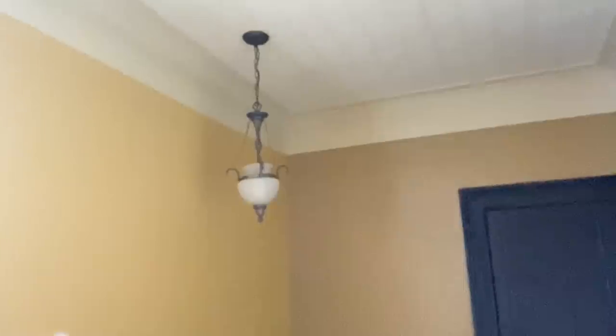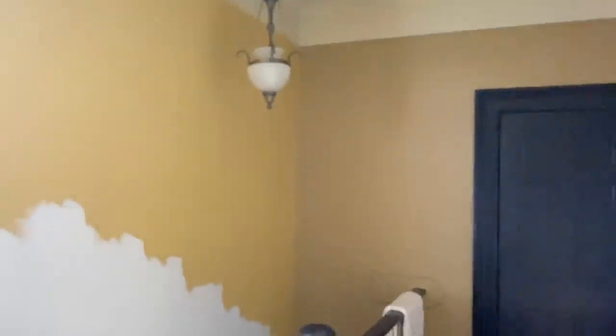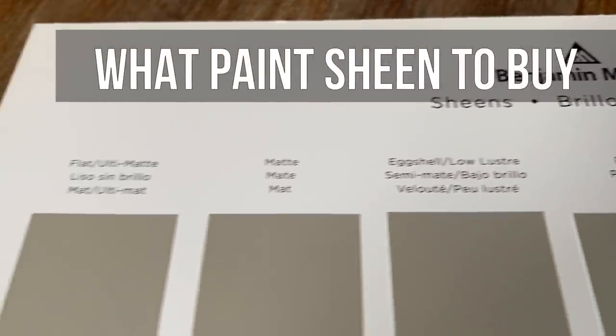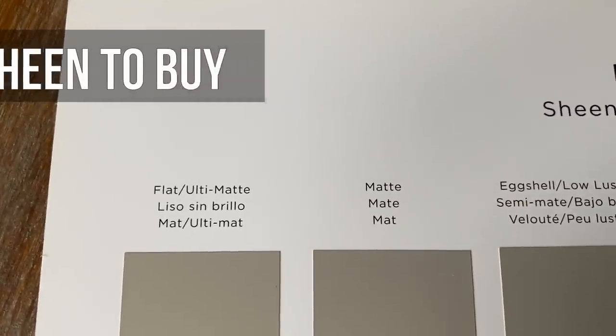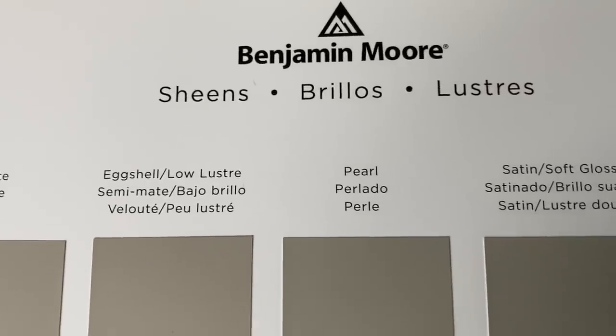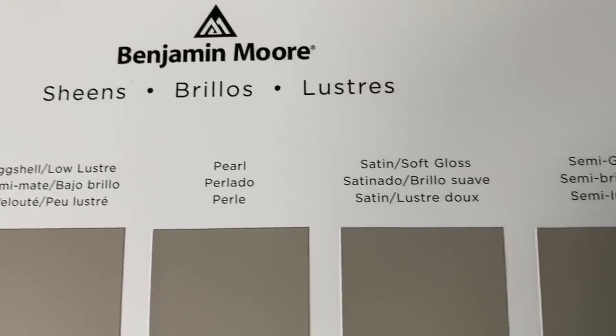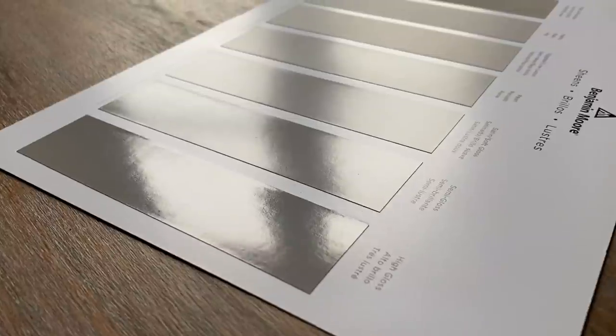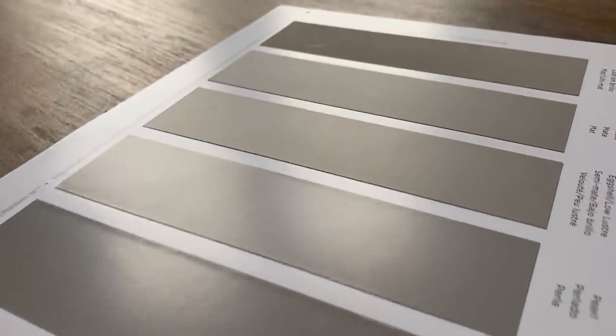I had to stop about halfway up this wall because I only completed the lower entry, and I really want to finish the upper entry hallway that leads into the bedrooms of this old home. I battle with the color in here and I'm dying to change it, but dealing with old finishes that are 130 years old means there are a lot of dings and knocks. To disguise this I want to quickly talk about what paint sheen to buy. For this old house I chose to use a lot of ultra matte and matte finishes and even chalk paint, but for newer homes low luster, pearl, soft gloss, semi-gloss, or even high gloss paints for trim and door frames can be hugely beneficial.